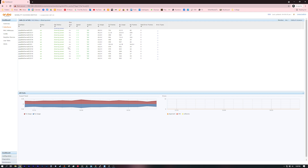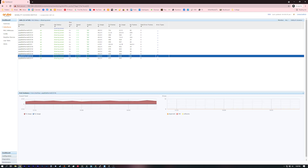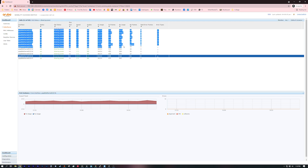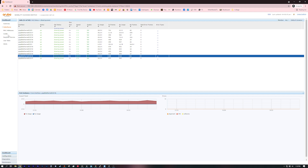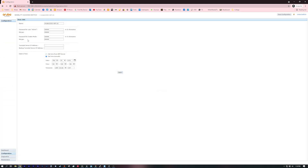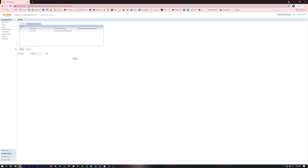We can see our interfaces and I'm going to sort by PoE status — drawing power — and here are all our ports. We can see the speed, I can tell just off of this that this is the G3 Flex camera, all running at full duplex. It shows transmit usage, receive usage, and I can go over to VLANs. I don't have any other VLANs set up here, but I'm going to go ahead and create one right now just to see what that process is like. So if I come down to configuration — this is where you'd change the time, the name of your switch — I'm going to rename the switch to Valence.